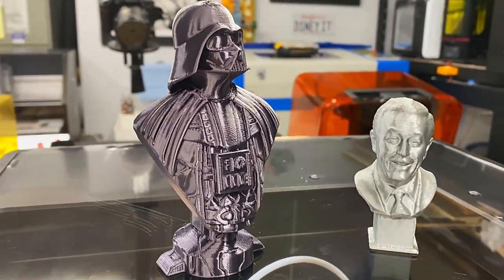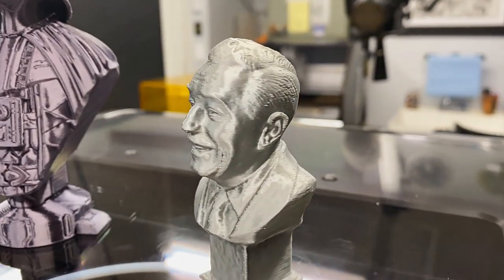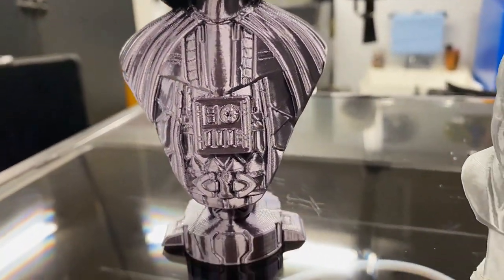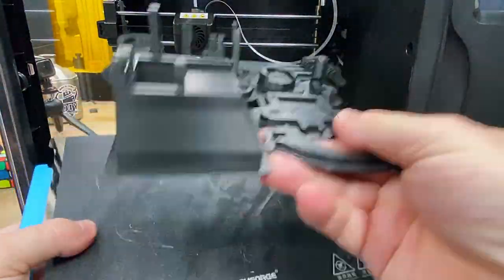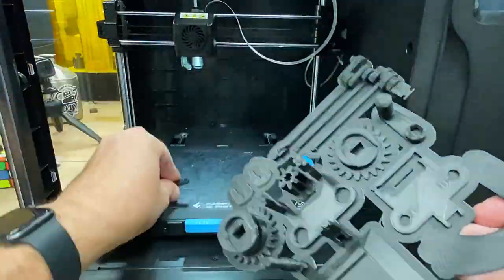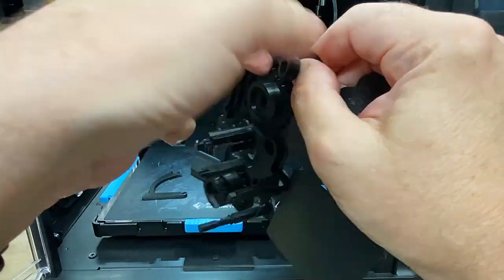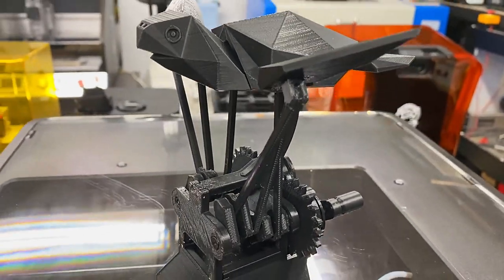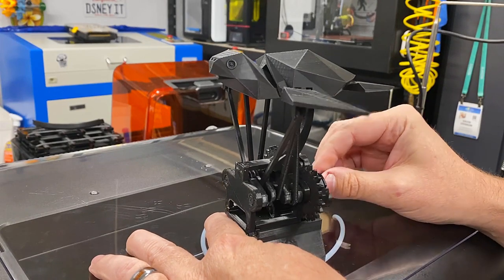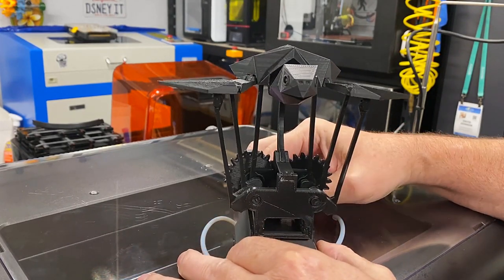Printing the same model at a reduced size in silk PLA turned out great. I also used some silk PLA to print a bust of Walt Disney by Barry 1685 — this printed well with great layers, no overextrusion or retraction issues, really nice quality in general. Finally, to test dimensional accuracy, I printed the flying turtle assembly by Amau Chan. These parts are more intricate, and the mechanical assembly is critically dependent on dimensional accuracy and extrusion precision to create hinged parts, gears, and components that all work together. Printed in black PLA with a raft at 0.15mm layer height and 40% infill, the Adventurer 4 printed them with ease — they all peeled easily off the raft, and after assembly the final result works like a charm. Links to all models used in this video are in the description.